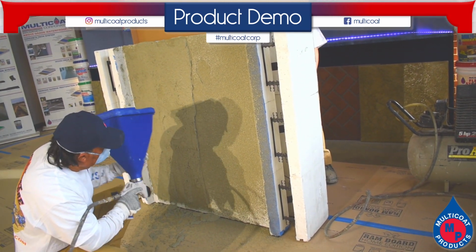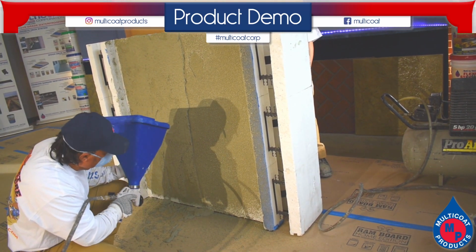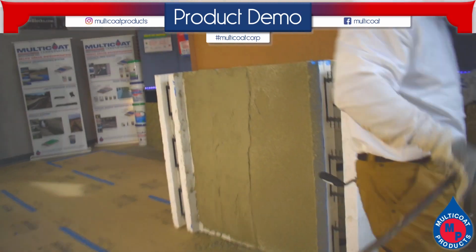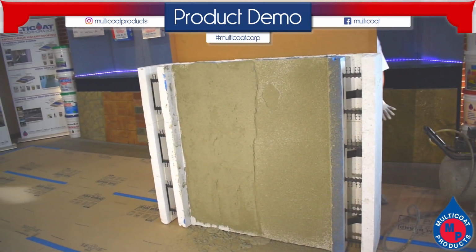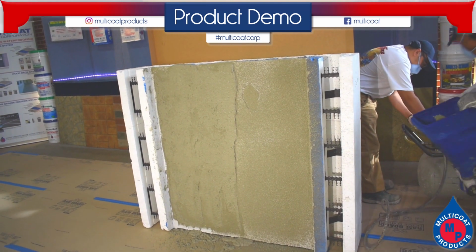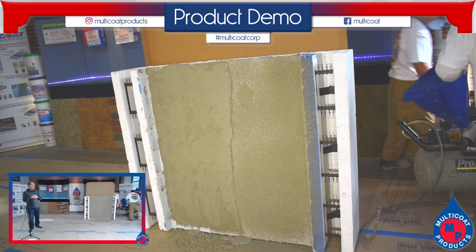Some advantages of our scratch coat compared to competitor products is we use a 16/20 silica in our product, which gives you a thicker sand. We have a couple of competitors that came into the business after us, and because of where they manufacture, they use 30 silica, so they have a much thinner sand. So with our product, you get a much better mechanical bite and less likelihood of delamination in any product using scratch coat.